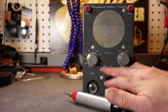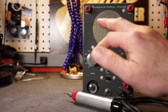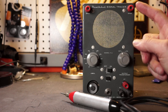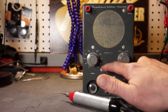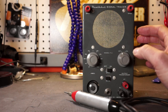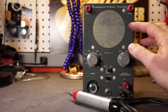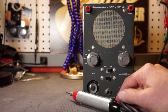There's another off/on switch here and it says 'SPKR' underneath, just like the labels on the two terminals. More than likely, what this does is deactivate the speaker. If these terminals are for connecting to an external speaker, this would take the internal speaker out of circuit — you don't want to have two speakers wired into the circuit. Also, if you've got an extreme amount of static or hum or noise and you just want to see what's going on with the circuit, you turn the speaker off and focus your attention on the magic eye tube.